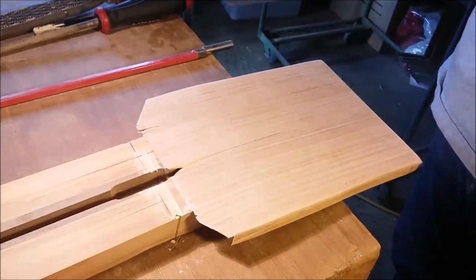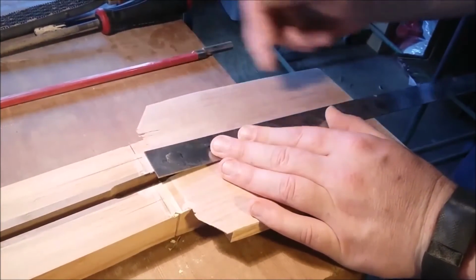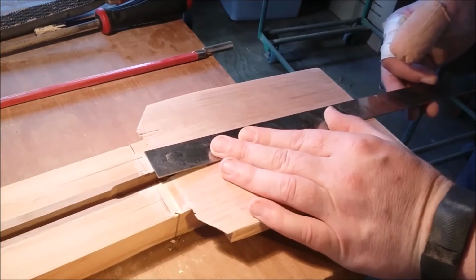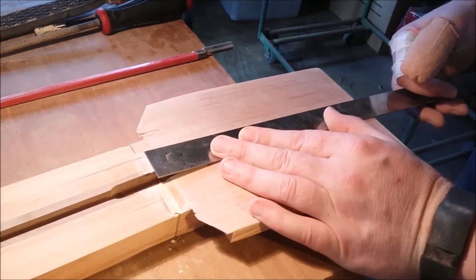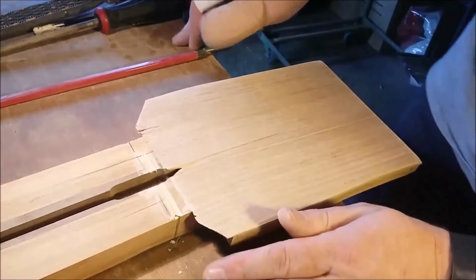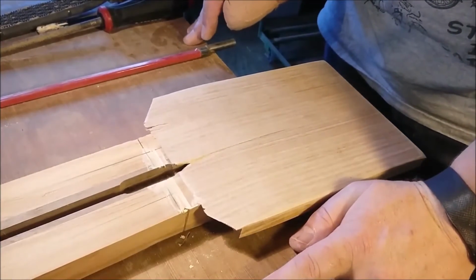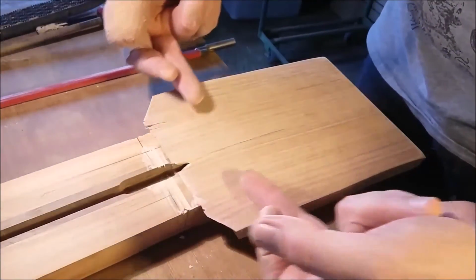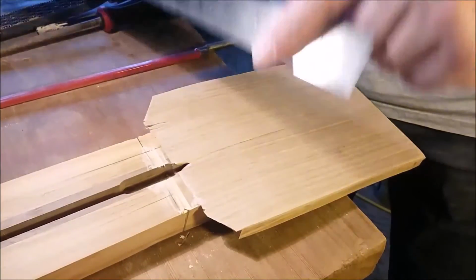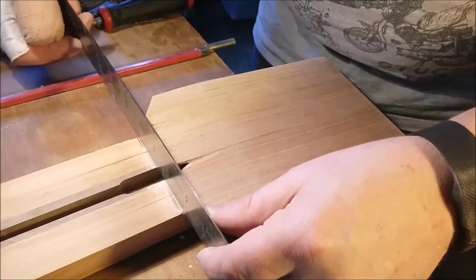I've already started here. But when the oak was on, it was like that. So the corner of the flat piece of oak stuck up here and I had to remove that. The right way to remove it was how I ultimately did it, which was firstly via some very coarse sanding, and then some finer sanding and planing, and now that's nicely level with the surface of the neck on which the fretboard will sit. But one dumb thing that I did, and maybe I would have done a better job if I was just generally better with the bandsaw, is I thought maybe I could bandsaw along here and cut it off, which isn't a completely crazy idea. But then I said to myself, well, I'll make it easy for myself. Imagine this is the blade of the bandsaw, and I'll just do a cut here to get the end of the oak off, and I cut just a fraction too far and touched the wood.